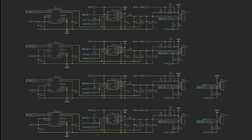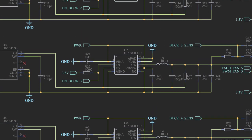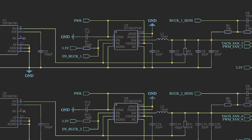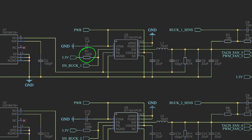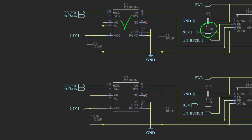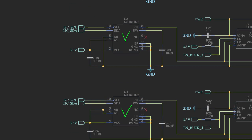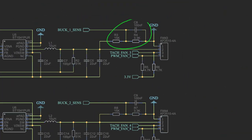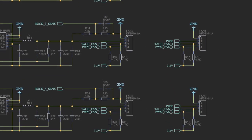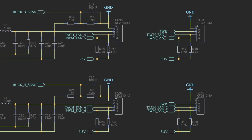On the schematic, I won't dwell on the DC-DC converters much — there are 4 identical ones; I had a video about a defective batch of the same type, but these are fine. The converter can operate at 100% duty cycle, essentially acting as a switch. Enable pins are pulled up to supply so that power is still delivered if the MCU fails. Digipots are initialized at startup to enter automatic mode based on their internal temperature sensors, working that way until the MCU takes over — a kind of backup system. Each output has a voltage divider feeding the corresponding ADC channel to monitor output voltages. As noted in comments, you could regulate voltage directly via PWM through a FET without DC-DC, but tachometer signals in 3-wire fans don't work that way.